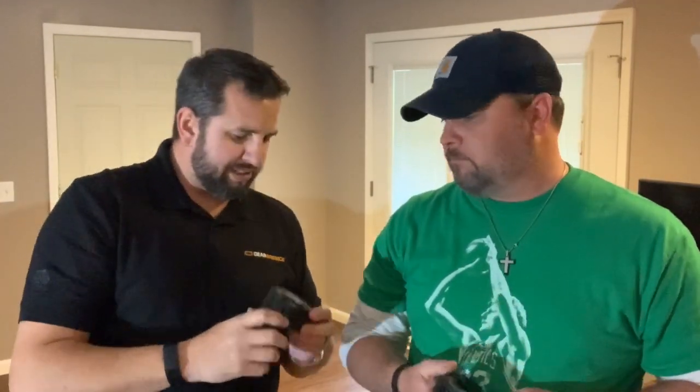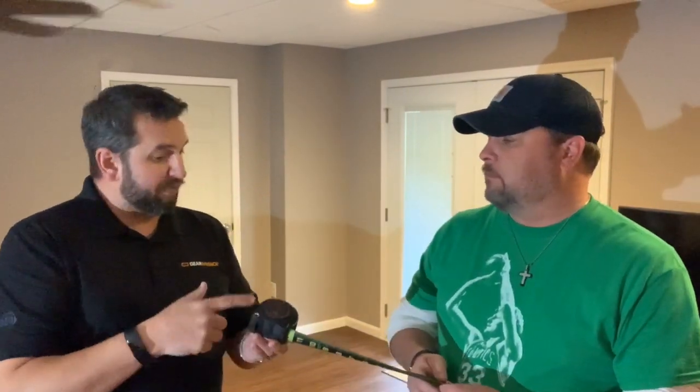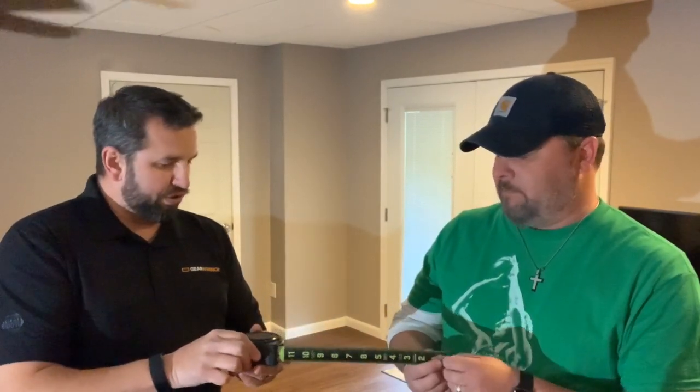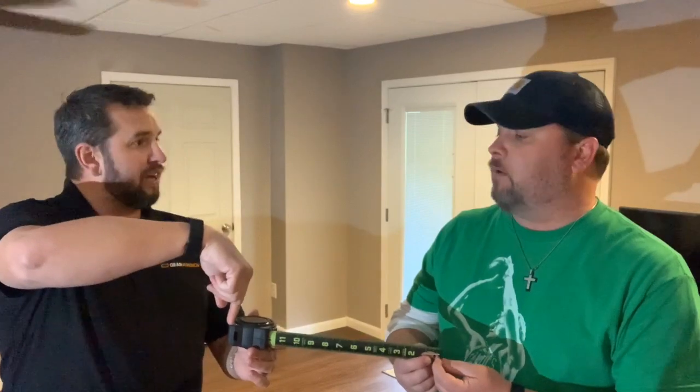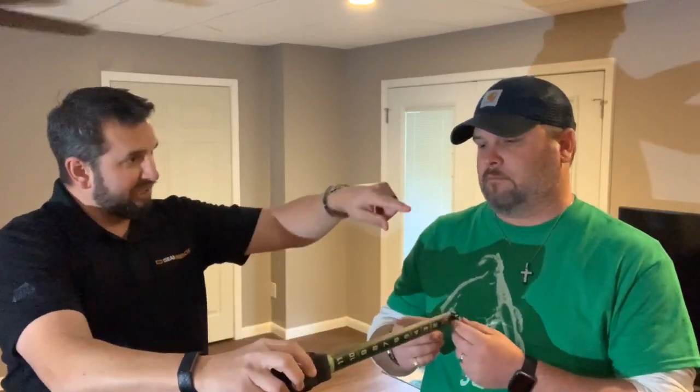Another cool feature — say you want to measure out a 15-inch hole to put in a window. I'm going to just use the nail here. We go out 12 inches because we have three inches of block. If you turn sideways as you're hooked and run your pencil through the scribing hole, with the pencil in place you can make a full 15-inch diameter circle so you know where to go in with your saw.